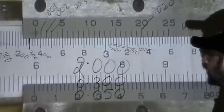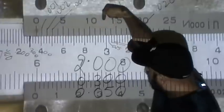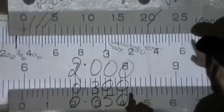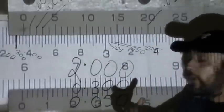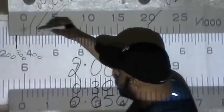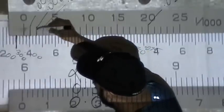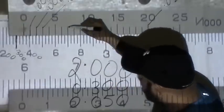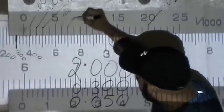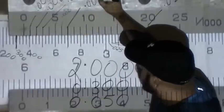You're looking for which line goes directly through or perfectly matches the line on the fixed scale. I can see that some lines are not matching — they're separate here, separate there, not matching. Continuing along: there's 5 right here, that's 5, that's .006, and this line right here goes right through — so that gives us .007.